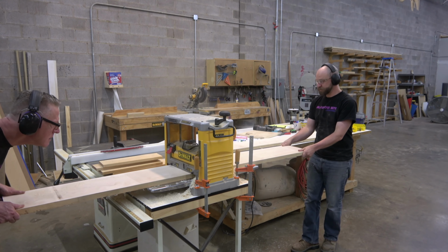Okay, so while I'm focusing on trying to make a cool looking shot, I have already made my first mistake. Like I said before, I wanted to make the troughs a little shallower than the tabs were long. So I cut the first bit out of what's gonna be a trough, running it this way, flipping it around, running it that way, and then moving the fence to walk it in. But I did that to my full half inch depth, and instead of, oh, actually that's not true. I didn't mess up, I just thought I messed up, because I'm gonna make my tabs long instead of my troughs shallow. So I'm good, and I'm second guessing myself. Shouldn't do that. Let me get back to work now.